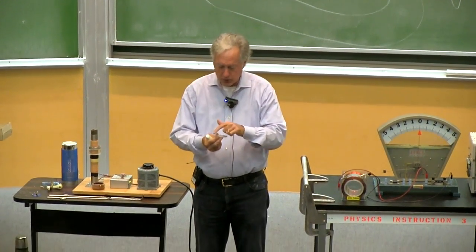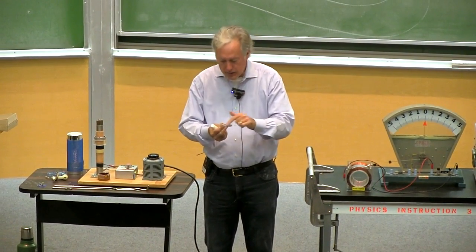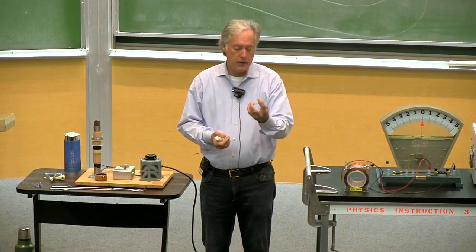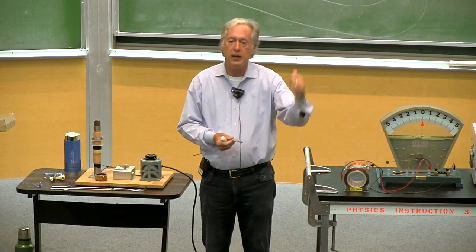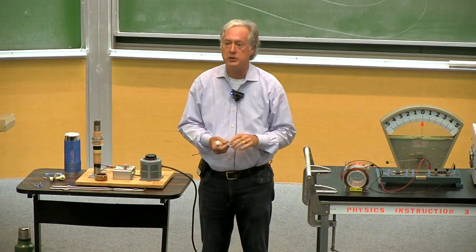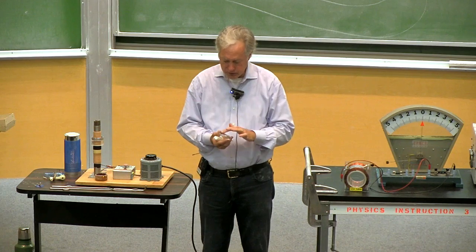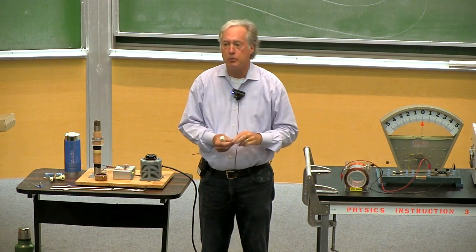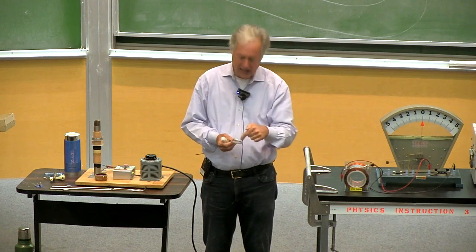You go around and come back to the same point, you do not arrive at the same potential. The electric field is pushing here. You go around, you go around, you go around, you're continuously changing. This is a non-conservative action. It is not going back around to the same potential. So it's the electric field that's pushing that is the way you need to think about it, and there isn't a zero in potential to go up from and then back to.